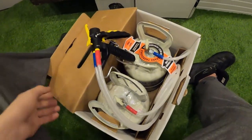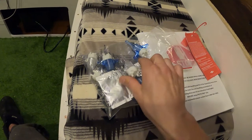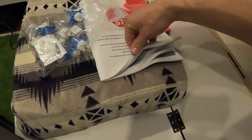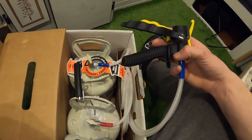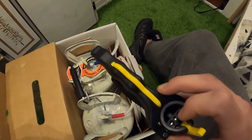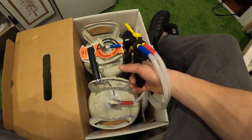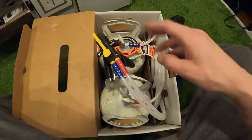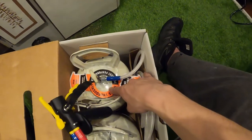All right, I'm in my van. I'm just gonna show you what the spray foam stuff looks like. So it comes in a box, it's all packaged. You open it up, there's these are the tips. Like a flat spray that kind of makes a wall, and then just the straight nozzle that shoots straight. There's enough literature for a couple nights of reading if you'd like. It's two canisters, so these mix in these tubes and then become the insulation stuff. You attach the tips into there and you can switch the tips. You got to make sure you do it cleanly and make sure it's all connected nice and clean. But then you just open those up. You want to spray it into like a trash can first. And give this time to mix evenly, and once you're getting a consistent spray out, you're pretty good to go. Oh, also, shake thoroughly for best performance.